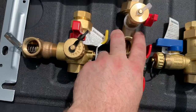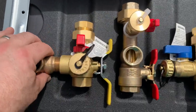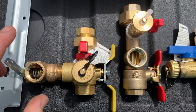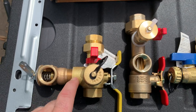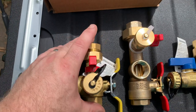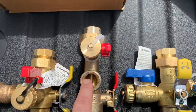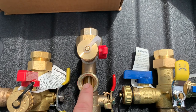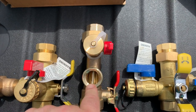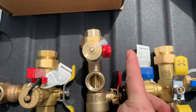When I set these side by side, a couple of different things to take note of. If you're installing in tight spaces underneath tankless water heaters — and they always are in tight spaces, in my opinion — the hot valve on the Webstone EXP E2 service kit is significantly shorter. So if you have a very tight spot, this valve will take up less space. Also take note: the relief valve is directly below the drain valve on the Watts/Navien Plum Easy kit. That can be less than optimal in tight spaces.